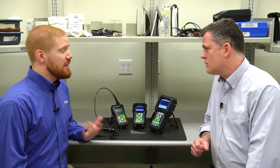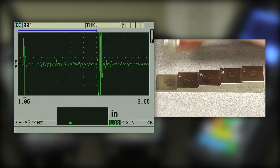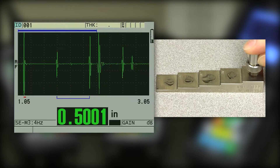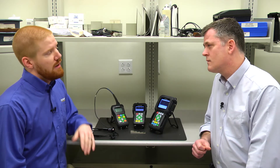With single elements, you're going to get a higher degree of accuracy. Based on how we make detection with single elements, if it's a flat steel test block with parallel front and back surfaces, it's usually plus or minus two thousandths of an inch or better depending on what mode of measurement you're using. If we use the single element delay line transducer and make detection between back wall to back wall, that's going to give us the best accuracy — in some applications as good as plus or minus a few ten thousandths of an inch. With the corrosion side, you're using dual element transducers. There are two elements, one that transmits the sound and one that receives the sound, and they're angled in at each other, which creates a pseudo focus. This gives us a much better chance at making measurements in the irregular back surface, because the sound won't get scattered away like it will with a single element.